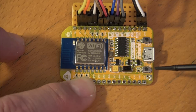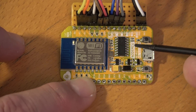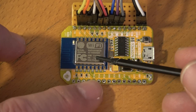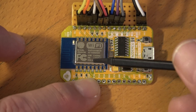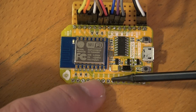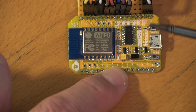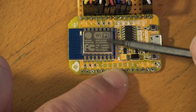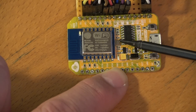Here's the little microprocessor I'm going to use for my double pulse timer circuit - it's a NodeMCU module. It's a little Wi-Fi enabled microprocessor, actually a reasonably powerful chip, but I'm not going to use any of the Wi-Fi functionality. I'm using this solely because it was already on my desk. Compared to other microprocessors it is a bit limited on I/O pins - it's only got one analog input - but that doesn't really bother me because I'm not connecting too much hardware to it.